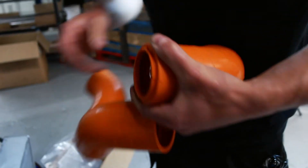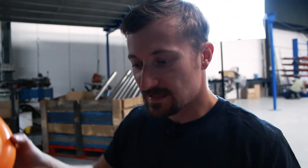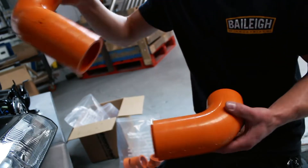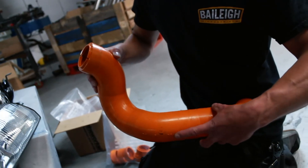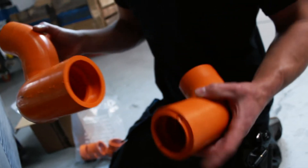So I made it all as one piece, but obviously we're not going to fit it through the hole in the chassis leg. The Skyline has a hole in the chassis leg where the boost pipe goes through — or the wing, whatever you want to call it. So we need to split this piece in an ideal place that we can actually fit the boost pipe. I had a six-inch straight in the middle here, so I've just cut that in half to see how it fits.